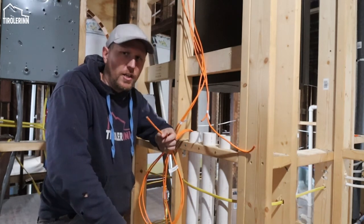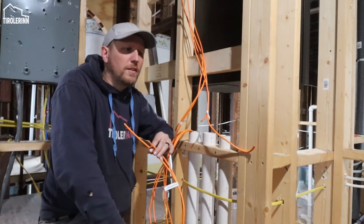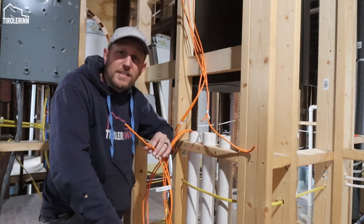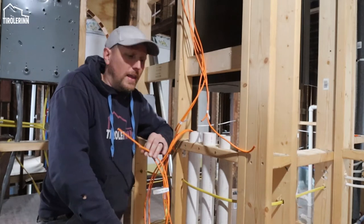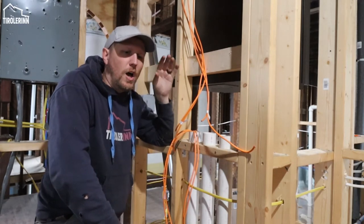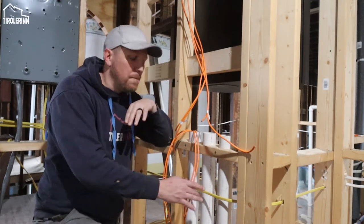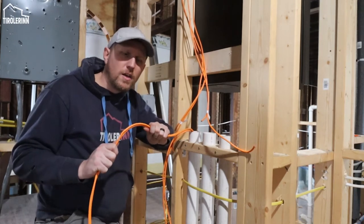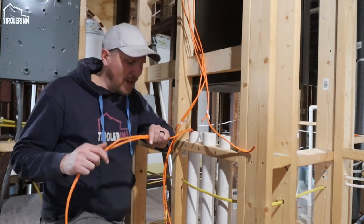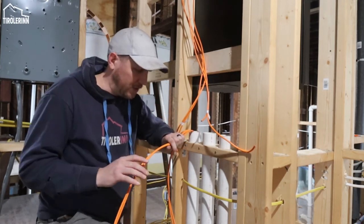It doesn't need to be shielded in residential buildings, especially given the bandwidth difference I would get with shielded versus unshielded, or even a CAT6A upgrade in a residential application. Even if I wanted to have AR or VR capabilities in the future, the distance that I'm running the cables is so short that I can still get a 10 gig line on one of those cables. So first of all, CAT6 is plenty for residential without shielding.